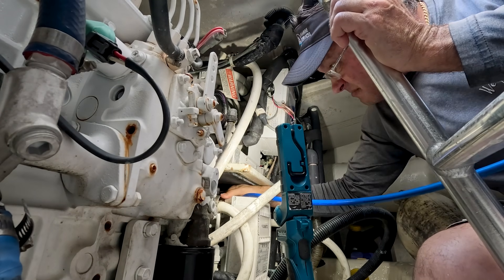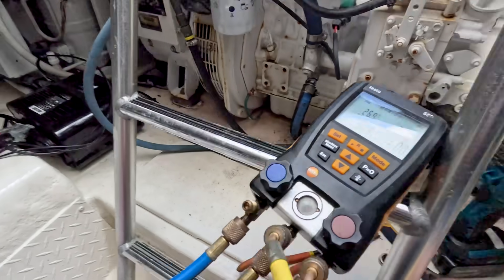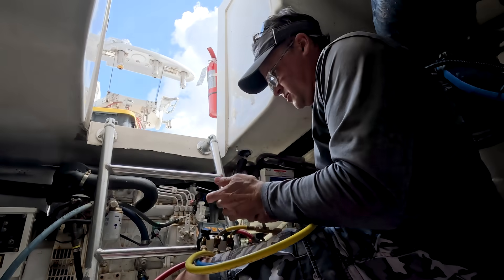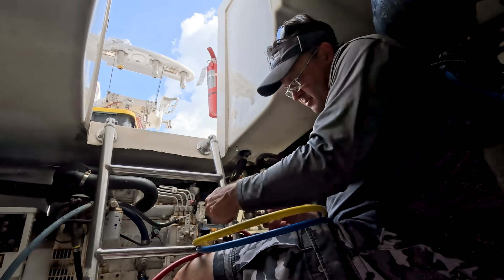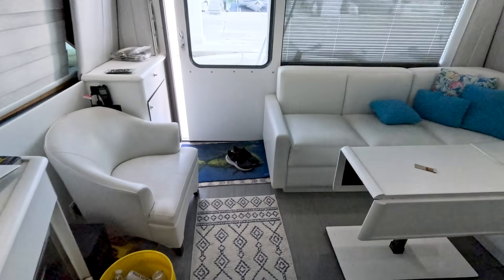Got that hooked up, that's open and good to go. Let's turn this on. It appears we are a little low, so we're going to put some refrigerant in there. Let me check my pressure-temperature chart here — we should be around 125 and we're not. So we're going to gas it up and see what happens. It appears it's cooling, but it does not have enough water flow. We're going to turn everything off and pull that strainer to make sure it's clean.